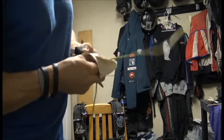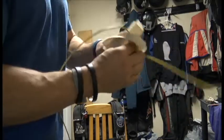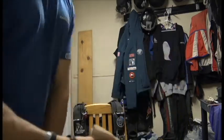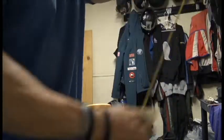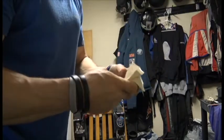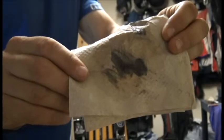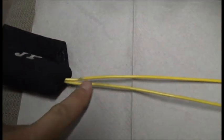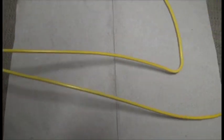Really focus on the middle portions and the tips of the cables, because once it's inside the housing and going through the three-ring release system, that's going to cause some hold-up if we're trying to cut away. You can see the dirt there. After we've done a good job of cleaning it, I'm not really worried about that little bit of dirt right there because it's really not going to affect the pull process.